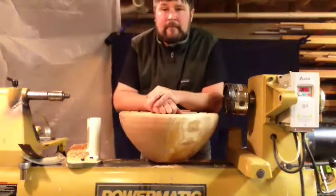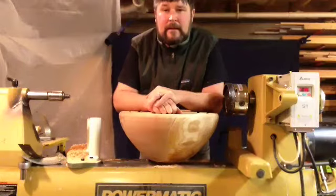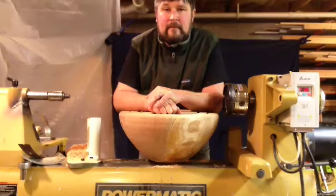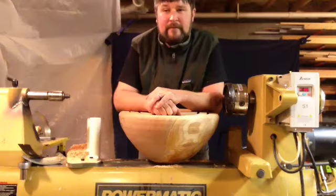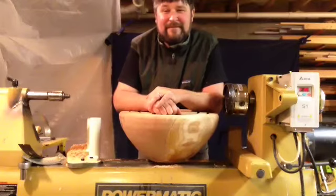So, Brett, I'm going to suggest this again and give this a try. This was something I got from Alan Lacer at the last symposium: the 10% is relative to the diameter of the bowl at its diameter. So basically, if you have an 18-inch bowl, you're at an inch and a half. As the bowl reduces in diameter, your wall thickness can reduce. You're following me? I've had very, very good luck with that premise. I still get cracks, but a much better yield than when I first started, like 20% yield.